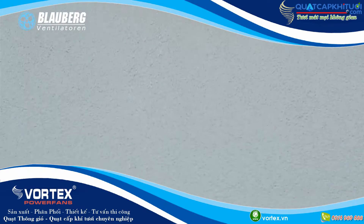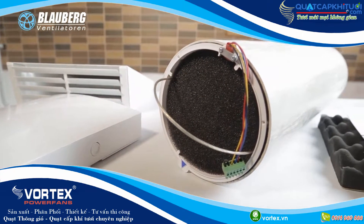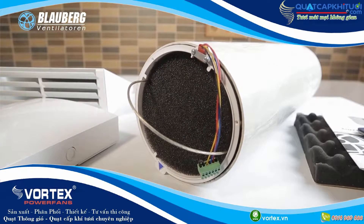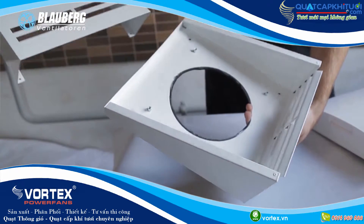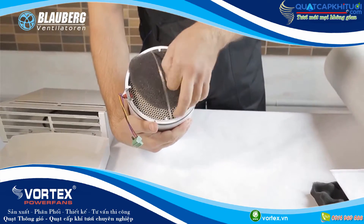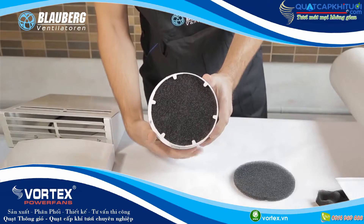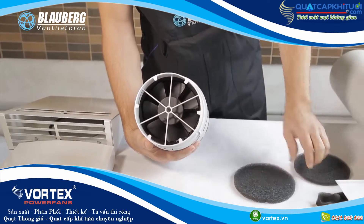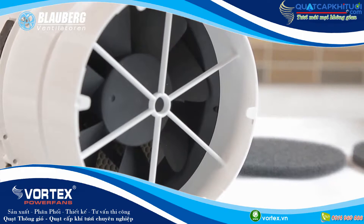The ventilation unit consists of an indoor assembly unit with a decorative front panel, a cartridge, an air duct with a sound absorbing material, and the outer ventilation hood. The cartridge is the basic functioning part of the ventilation unit. It consists of a fan, an energy regenerator, and two filters that ensure rough air filtration and prevent ingress of dust and foreign objects into the energy regenerator and the fan.